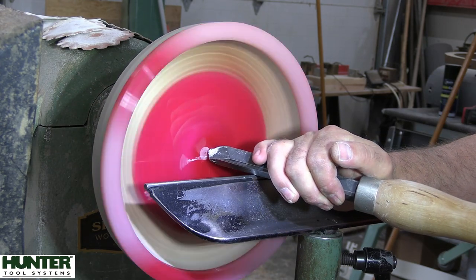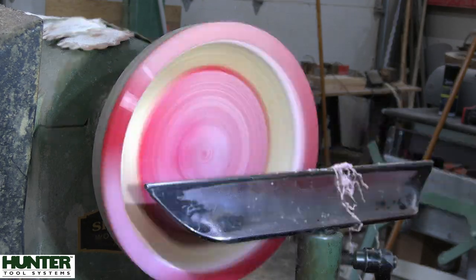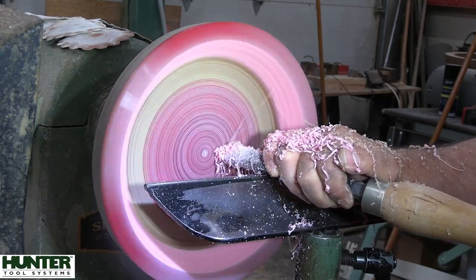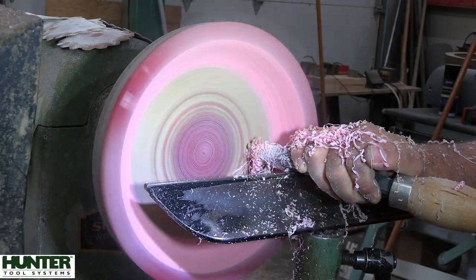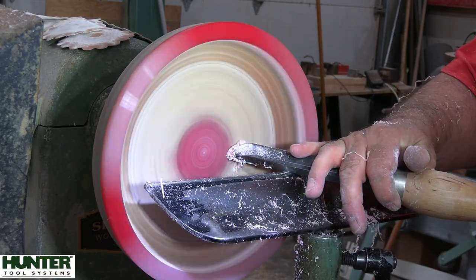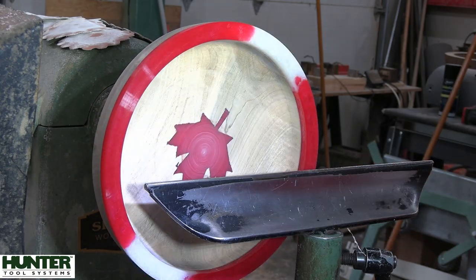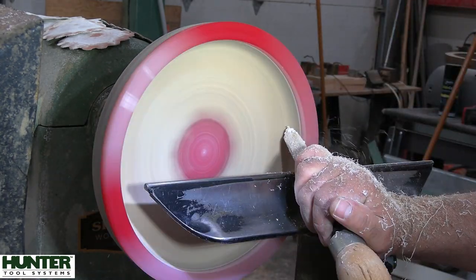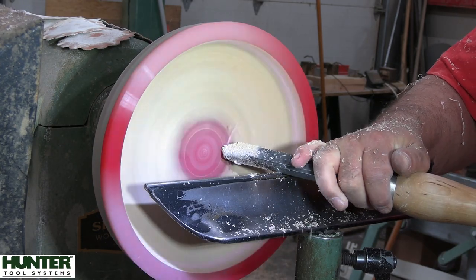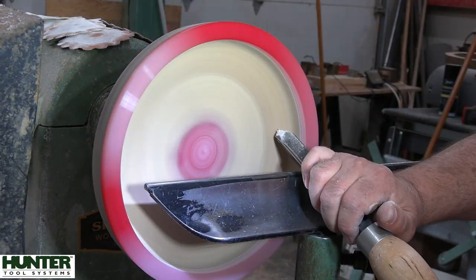All right, so it is the next day. Here I'm using the Hercules just to trim back the resin. It's really important here that you don't take off too much material — I just really wanted to expose the leaf and that was it. If you go too deep, then you're going to see probably the base wood color coming through the inlay in the very center of the bowl. You'll also probably notice that before I put the bowl in the pressure pot, I just swished the resin back and forth to fill in some of that cracked grain up by the white part on the bowl — that's why you'd see that there. It didn't migrate — I did that purposely — and it actually did a good job. It filled in those areas, though I still had to use some Starbond afterwards, but for the most part it was mostly filled in by the resin.